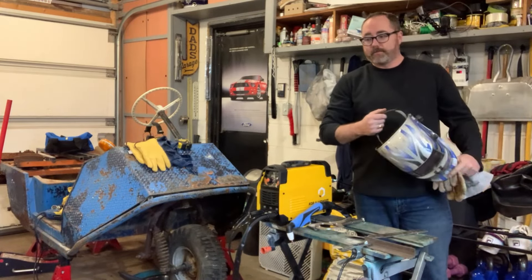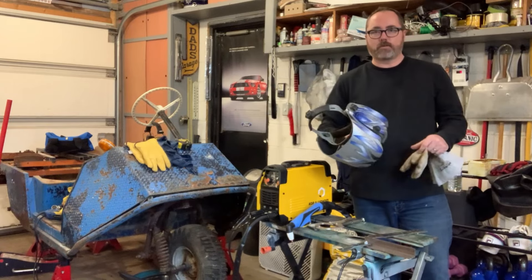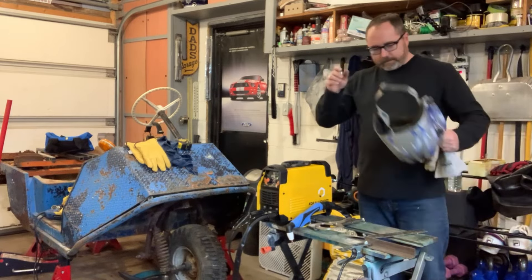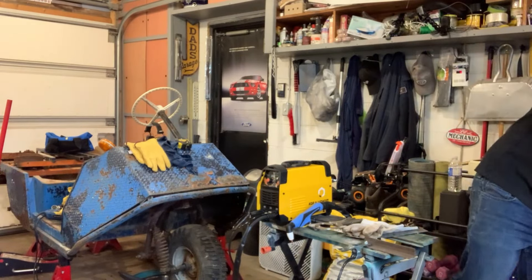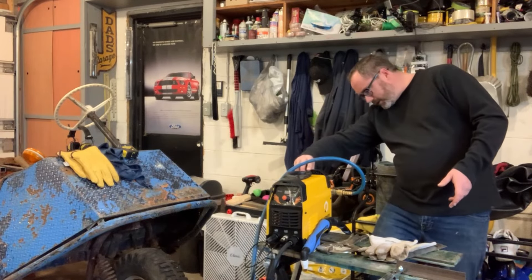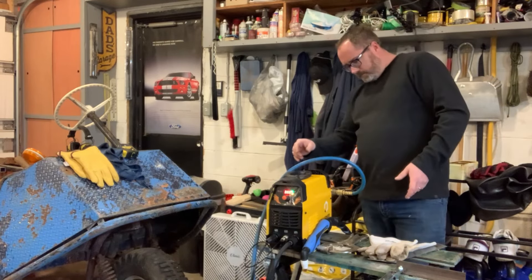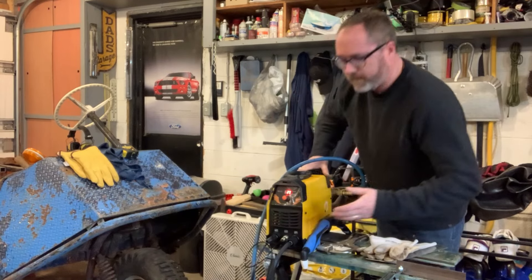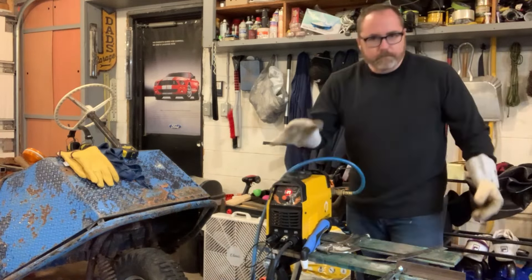I'm going to put on my welding gloves to protect my hands, partly because I don't know exactly what this machine is going to do when I fire it up. I'll wear my welding helmet on a grind setting — not so much worried about a welding flash as about slag flying up and hitting me in the eyes. The chart says 30 to 70 PSI, so I've got it at about 50 PSI and I've got it set at 20 amps, since it's on a 20 amp breaker. There's a fire extinguisher nearby.